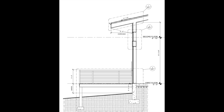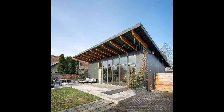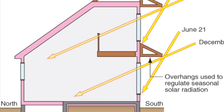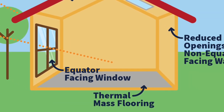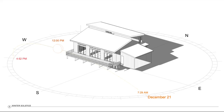The size of your overhang is dependent on where you are located on the earth, and there are so many designs to choose from. The biggest thing to remember is that it's all about blocking the sun during the summer and allowing the sun to enter through windows or glass doors during the winter months. In contrast, here is December 21st at high noon, and you can see there's actually about 15 feet of sun entry through those sliding glass doors and the windows above them. You also need a thermal mass — in our case we're using slab-on-grade construction, so that concrete floor is the finished floor. The sunlight naturally heats that slab during winter, and after the sun goes down the thermal mass continues to radiate heat, making the living conditions really comfortable.